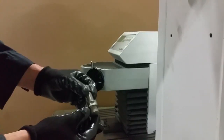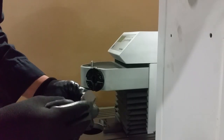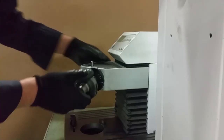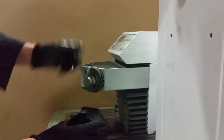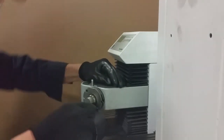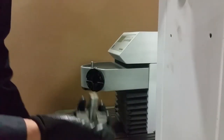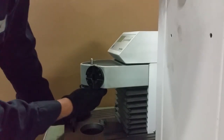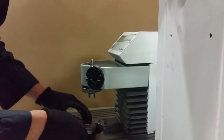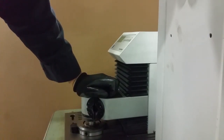If you would like to use a special shape punch — this is round with a pin — there isn't any flat surface to use for alignment. For that reason, there is this kind of surface over here. Just put it in there, lock it, use this part of the quick set, and press the bridge down. You can see there isn't any gap, so just tighten it up — this part is good to go. You want to verify there won't be any collision, so put it here and use your die. Of course it has to have the same shape — makes sense. If you have no collision in the quick set, you will not have any collision on the machine.